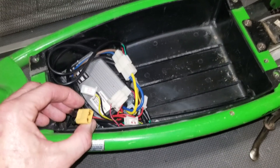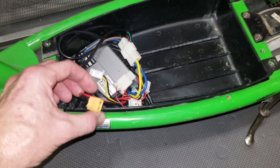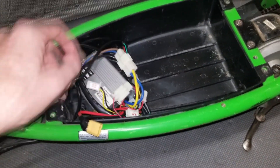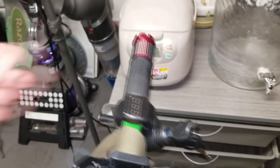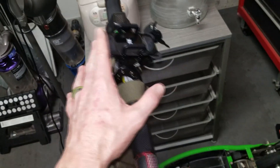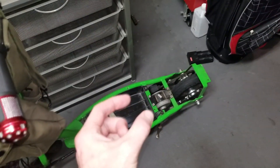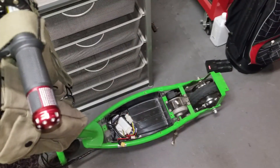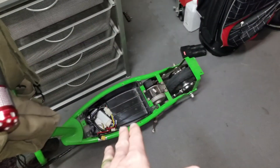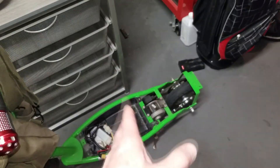That connector goes to my 1000 watt controller male plug — and that's how you get 48 inline volts out of two battery packs designed for drills or battery-operated tools. Stay tuned for my full explanation of the 1000 watt controller. I also put in a variable throttle, a saddle bag, and a cell phone holder. This is the E200 — the same method can be applied to the E300, which I'll eventually be upgrading to myself.